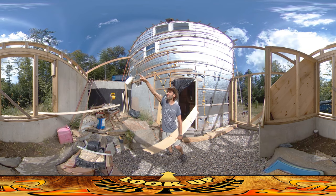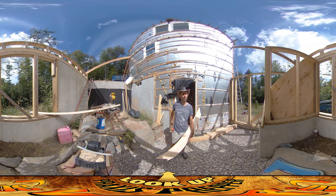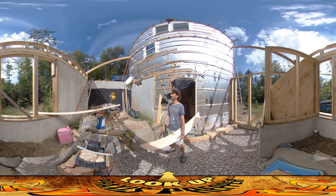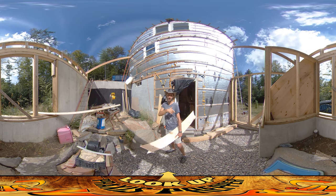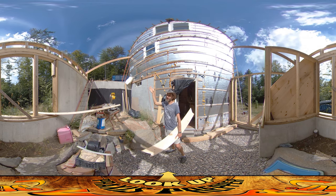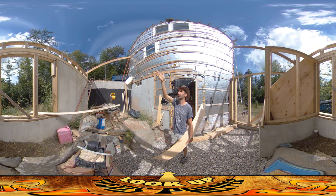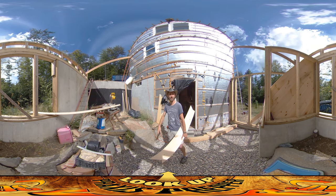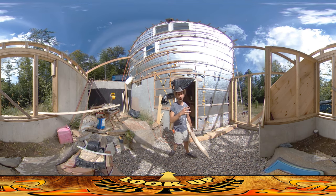I just finished up these two-foot center mini studs behind you — that is the last layer that goes on before the rafters go on. My dad's going to be on site tomorrow and we're going to get a lot of rafters up. We should fly pretty fast since the hangers are already there; just got to notch them and put them in. We might get them all done tomorrow, which will be cool. But what I'm working on right now prior to that is rigidifying the structure.